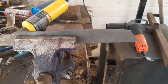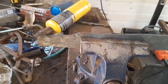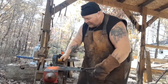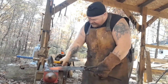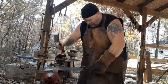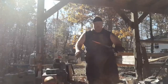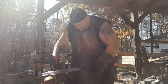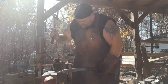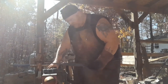We've gone ahead and cut the tip in like I was saying, and we've cut the tang down just a bit because we had a bit too much metal. Now we're going to draw that out into our stick tang. Working on the tang now, putting it on the edge of the anvil — you can see it's already starting to come out nicely. The stick tang is pretty close and it's going to be just about ready for the next process.